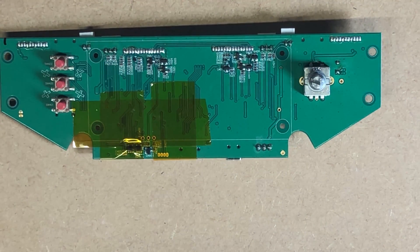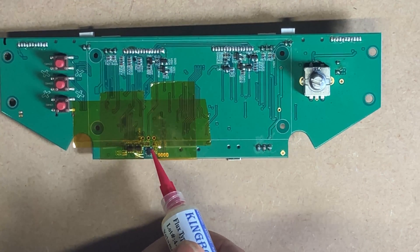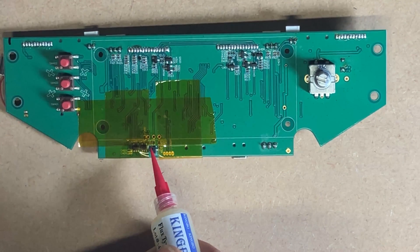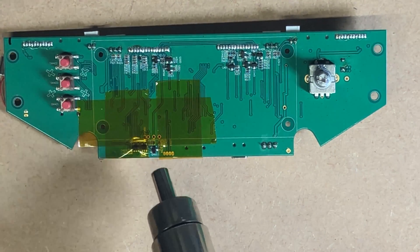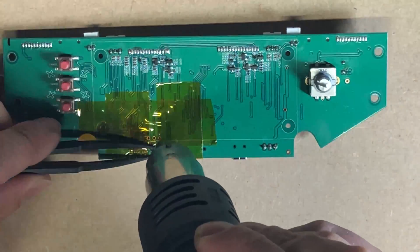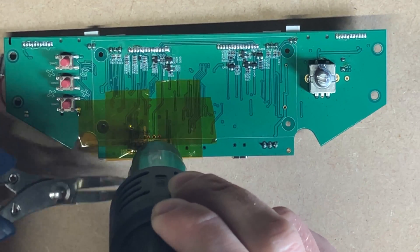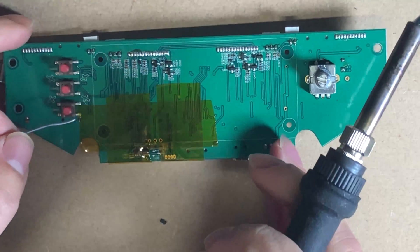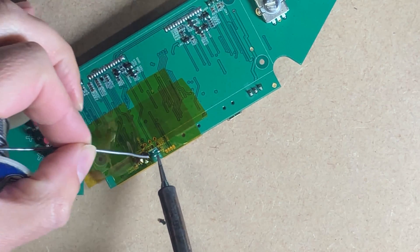Now we've got the main board — you can see the chip there at the bottom, just off to the left of the middle of your screen. That black chip is the one we're going to be removing. I'm going to put some flux paste around that chip to help with conductivity and removing it. There are just three points on there. I have a reflow or rework station so it's just easier for me to use this. I'm going to heat that up until I can see the flux paste gather around the middle of that chip and then remove it. Then I'm just going to re-tin those solder points.